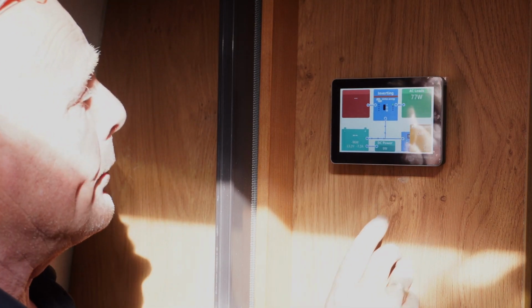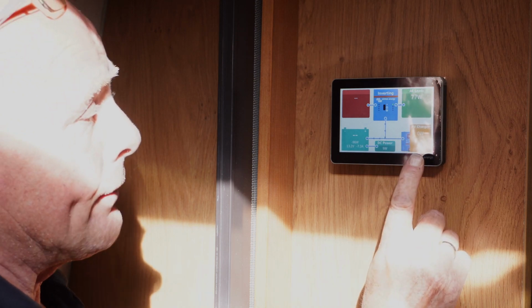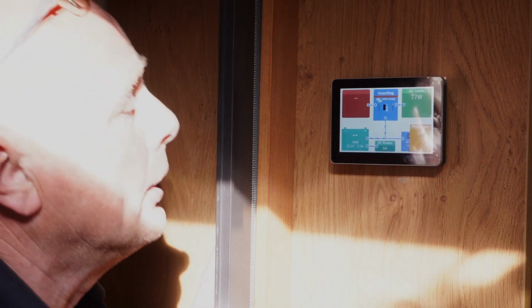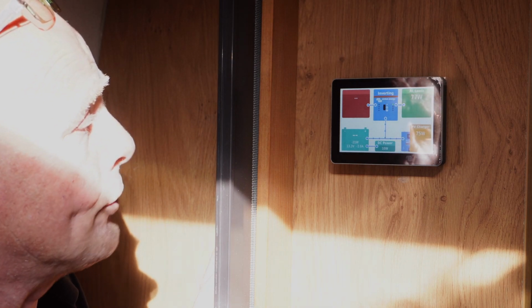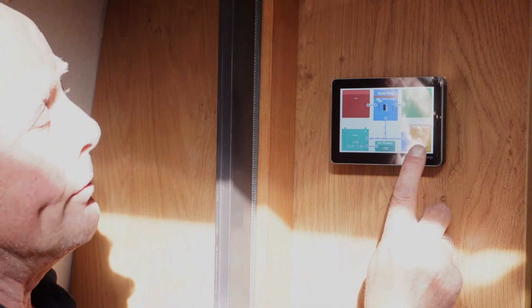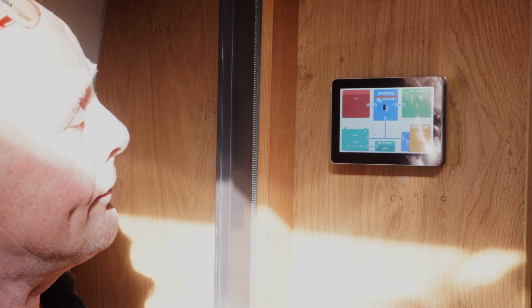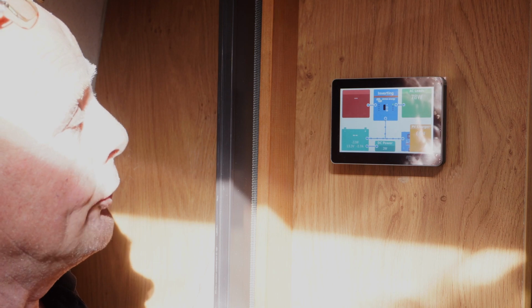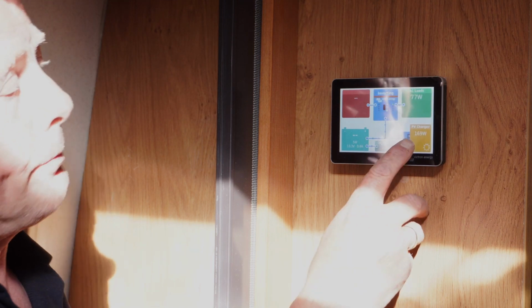But what we'll do now is turn the solar on, and although it's 5 o'clock in the afternoon, I suspect that the forward panels should be producing 100 or so watts altogether. At the moment it's just coming online and we've got 85. Yeah, I thought it would be a bit more power than that, but the sun is low. It's 5. Oh no, it's just jumped up to 160, 170 watts.